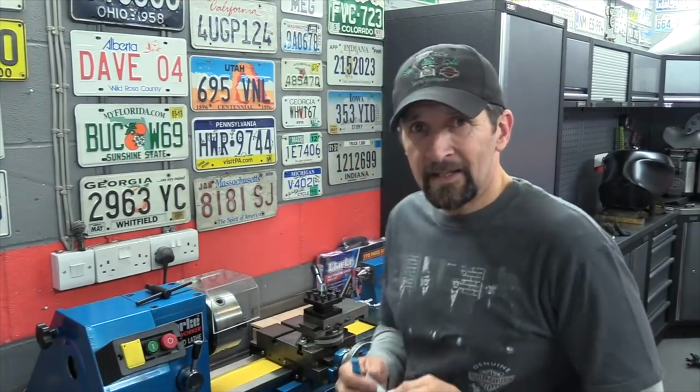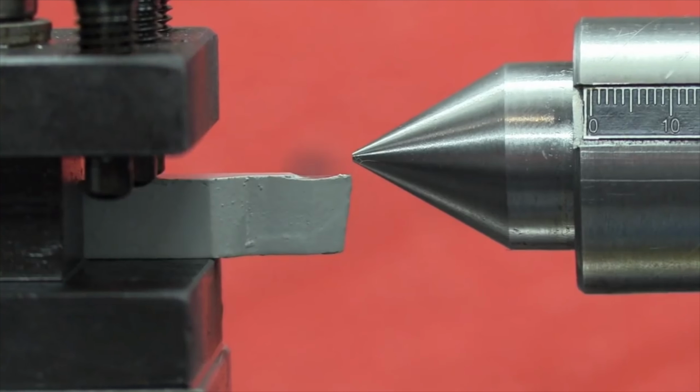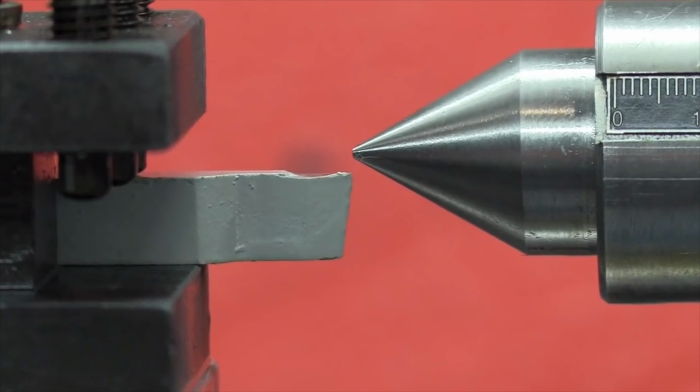So there we are. Sadly, that stops play, I'm afraid. Sorry about that. I really wanted to do a cutting operation today, but as you saw, the general cutting tool, which is the one I would use today, is too low by about 2 mil, and I definitely need to shim that up so it's the correct height, and I cannot move forward until I've got those shims. They should be here on Saturday afternoon. So as soon as that's done, then I'll have that hopefully for the next video on this. Something interesting, perhaps even make something.